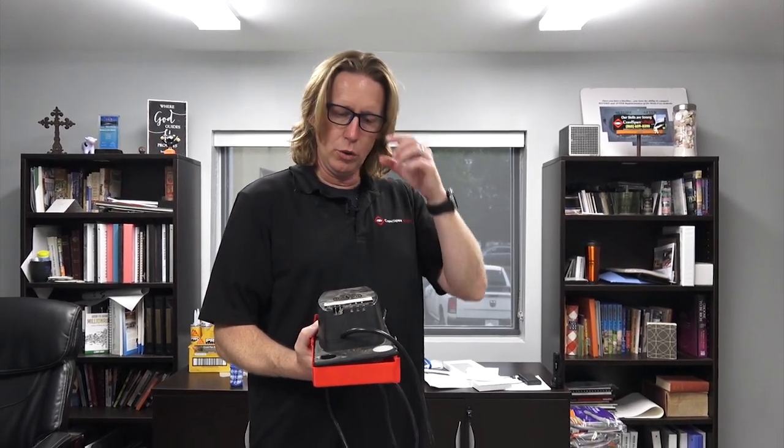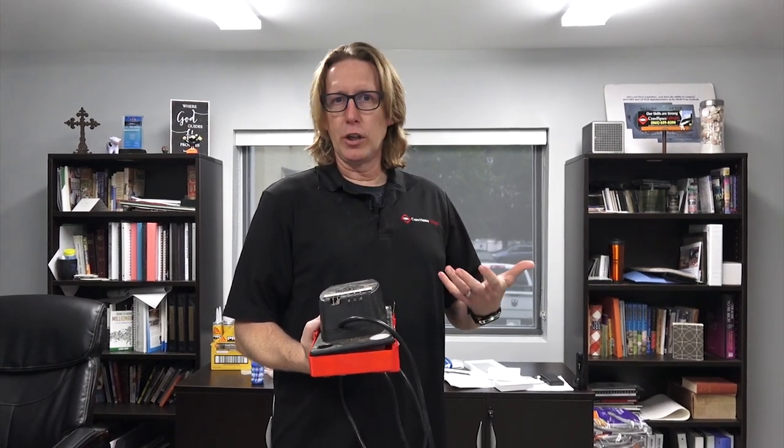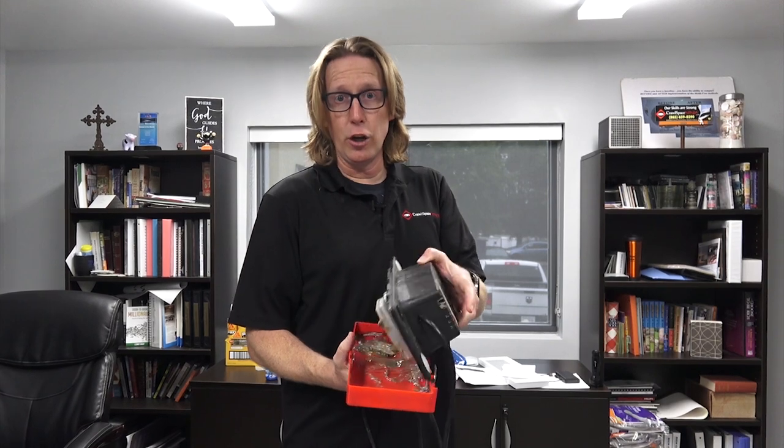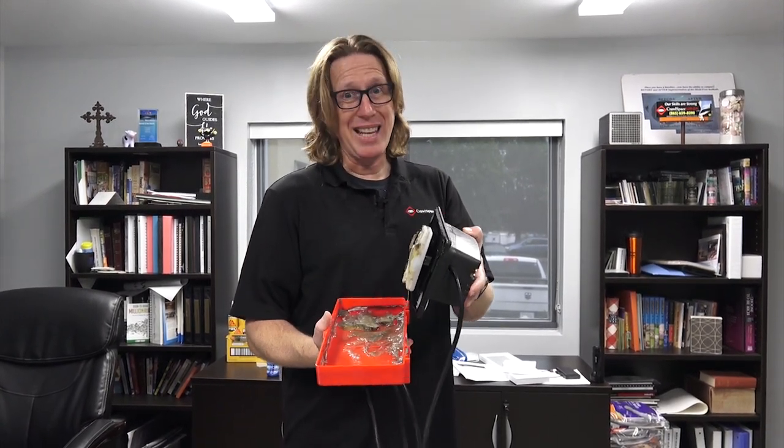If this is hooked up to a dehumidifier, it needs to be maintained. Whatever this is hooked up to, you need to clean this out on a regular basis. This is 2 years of no maintenance, okay? And we had to replace it because it died. So if you want your condensate pumps to live longer, maintain them properly.